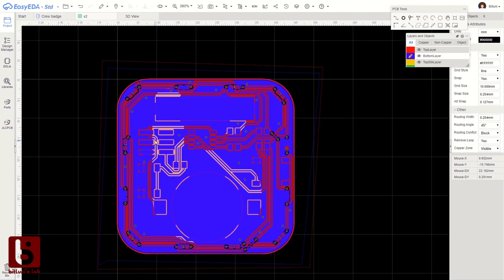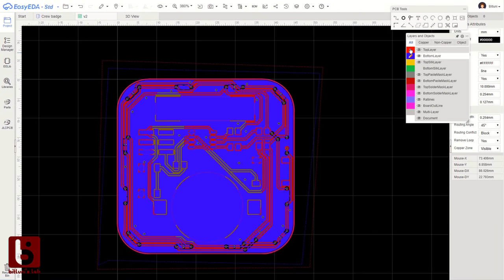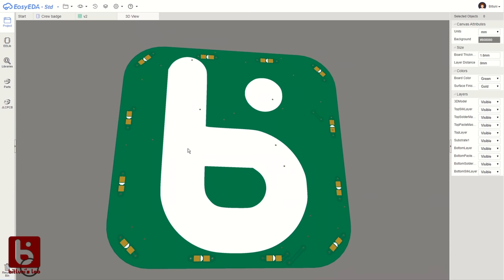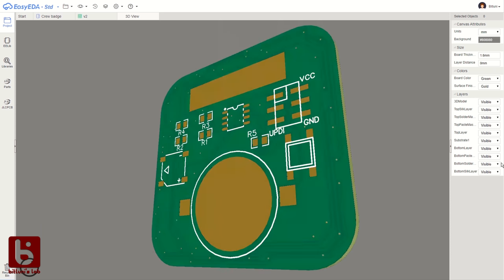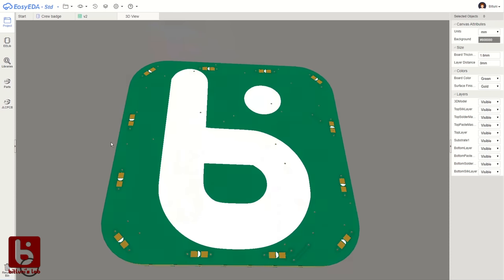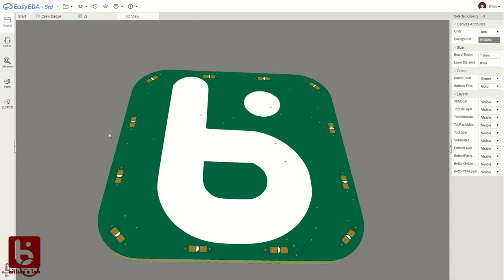A major disadvantage with the new service is that you can only assemble one side. I decided to let JLC assemble the tiny 0603 LEDs, since they have to be oriented correctly and are a pain in the ass to solder. The other side uses only 0805 components that should be really easy to handle. No worries, I will also show a more complex design in a second.